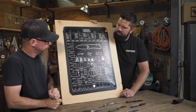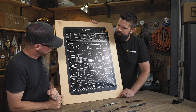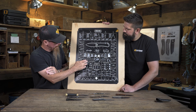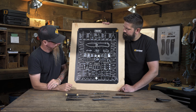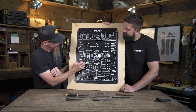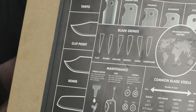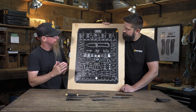Which one would you say is probably most common out there? It's a good question. There's a lot of hollow grind out there and there's a lot of flat grind — those would be my two as far as the primary. And when you get into actually sharpening down at the bevel, the two most popular are flat and convex.